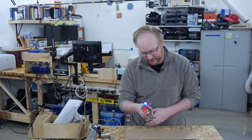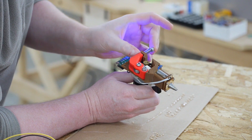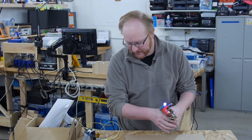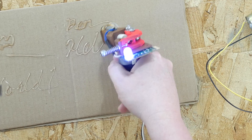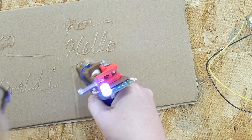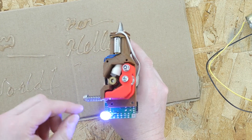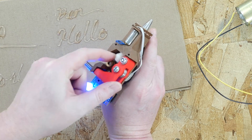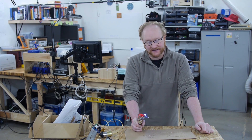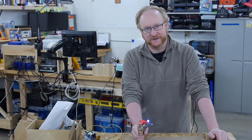This one has a really aggressive grip wheel. It's got this spring-loaded mechanism here that pinches it. Before we were trying just kind of a passive pinch, but maybe we need to step up our game. Something else I noticed: if you actually expend the glue stick, see how it doesn't line up correctly — that's a flaw. Maybe there could be a sensor. You actually probably could sense the current; if there was no glue stick, the current drawn by the motor would be different.